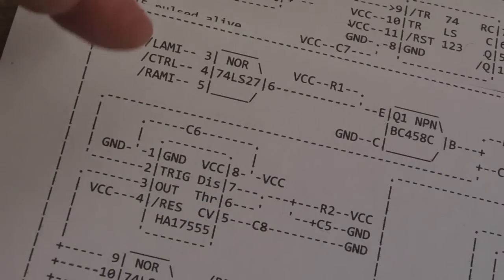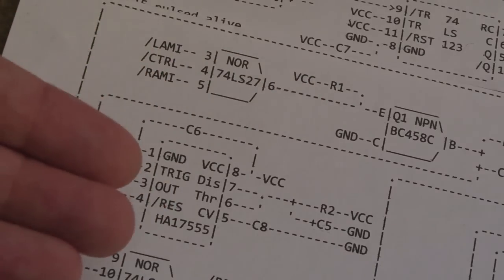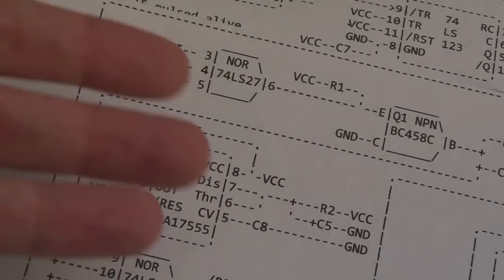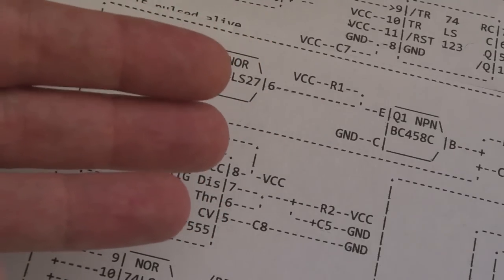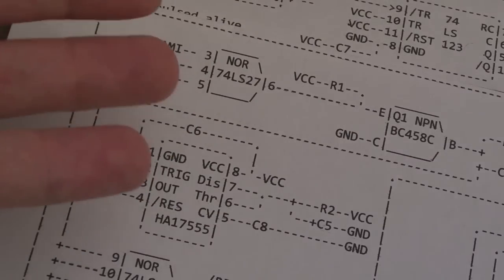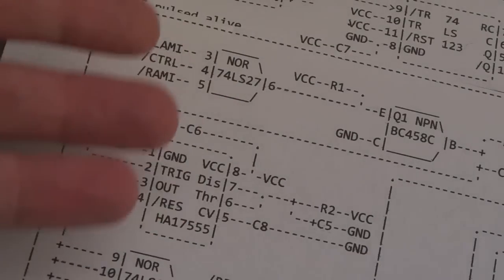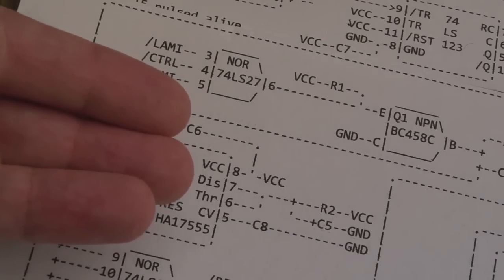The key is the signal: you've got your reset, you've pressed your three keys, it comes through this transistor, and that signal comes down into the trigger of the 555. So Ctrl-Amiga-Amiga, when Q1 was configured, would be resetting the reset circuitry — the reset goes back around to the MCU on the keyboard. I think I over-engineered what I was theorizing. What I think is actually happening is: Ctrl-Amiga-Amiga triggers a reset so the MCU is stopped in its tracks very quickly — too quickly to then do something with the data signal.